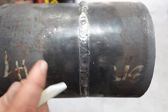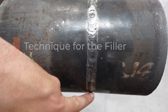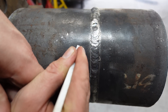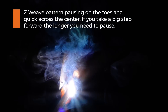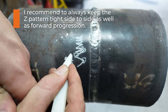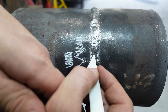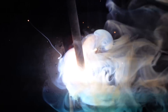The machine is set up — now let's talk technique. We've got the cap here and we can see there's a little bit of reinforcement compared to down here where nothing is sticking up past flush. We want to maintain these bevel edges. As far as technique goes, I'm only doing this z-weave pattern — just side to side, pausing on each side, making sure it fills in. The more you go up in your z-pattern, the longer you've got to pause. So it's really important to keep this z-pattern nice and tight so that everything fills in. We also want to make sure we're not going outside these bevel edges. We stay well inside so the puddle fills out without hitting that bevel edge.